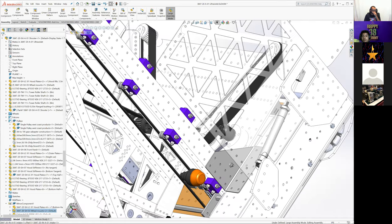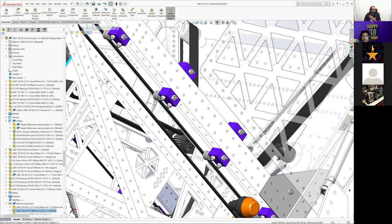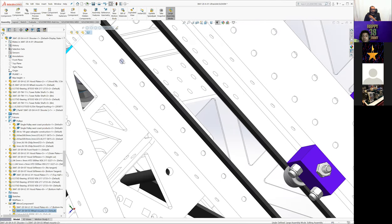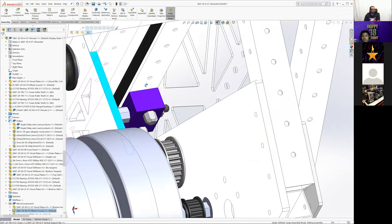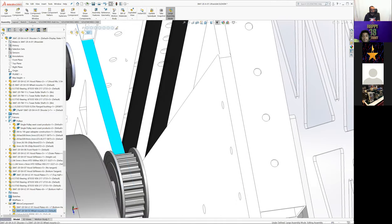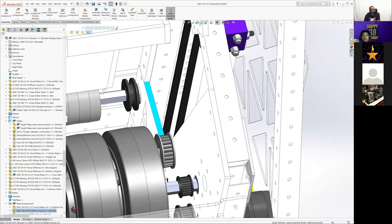So in the real robot, one of these holes is drilled out so we can stick a 1/4-20 bolt through and bolt it in. This does the bushing trick too, I'm pretty sure. There's a 1/4-inch ID bushing in this bearing here, and a 1/4-20 bolt is holding this back shaft in place.